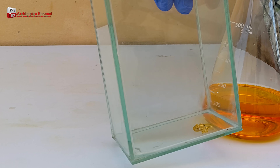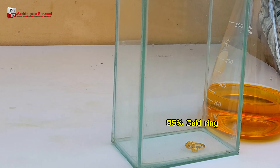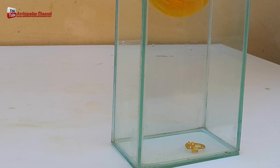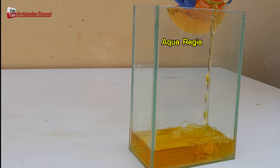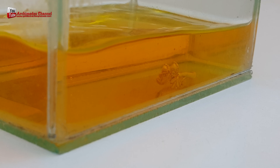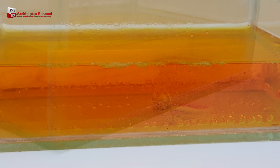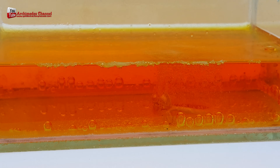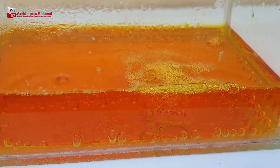In some cases, if gold is mixed evenly in the alloy and at a low enough concentration, you can use plain nitric acid to dissolve away impurities. However, if the gold is more pure or is an external plating, what actually happens is that the nitric acid tries to dissolve everything, but the gold blocks it from coming through. In that case, you purify an outer layer, but the internal layers are not pure because they are protected by an insoluble layer of gold.